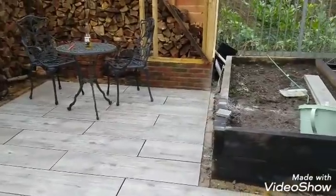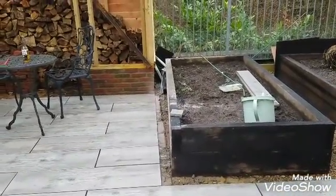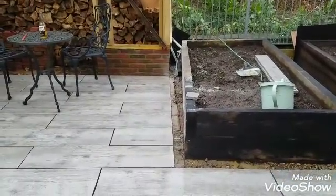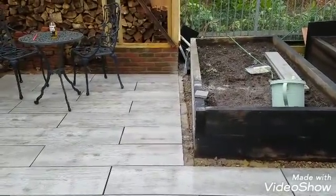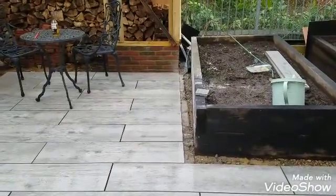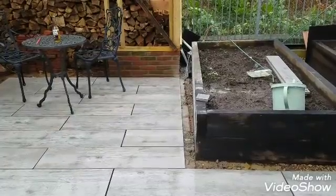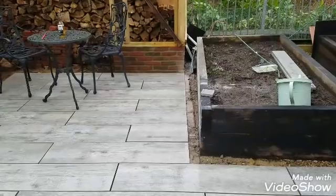And as you can see down there, I have to straighten up that raised bed now because that was here obviously before everything else. So if you look down that edge there, that's what I've cut with a Ruby 4-inch porcelain blade, and it's worked perfectly. The only thing you've got to watch is when you're cutting through porcelain, try and cut nice and even, because it causes tension otherwise and it can split off.